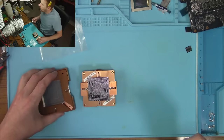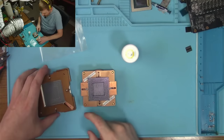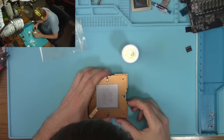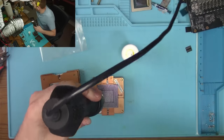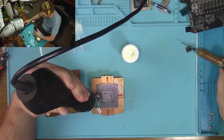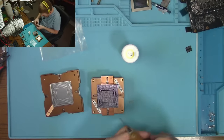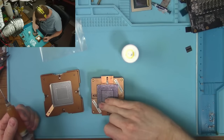So the one thing I don't like about 0.5 millimeter balls is that the stencil is 0.5 millimeter. And why is that a problem, you may ask? The problem is these balls don't really fit very well. They do not fit well into a 0.5 millimeter stencil. Don't know why. The 0.45 millimeter balls fit very nicely with a little bit of wiggle room, but